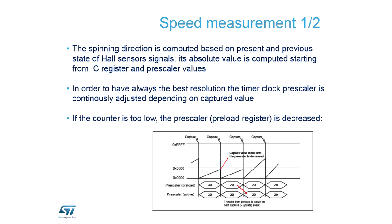We define a threshold and count between edge captures coming from the hall sensors combined through XOR to one event. These capture events reset the timer. In the interrupt service routine we decide: if the value is less than a threshold, precision is not good, so we change the prescaler to put faster impulses — the slope is faster. Using shadow registers, when we change the prescaler to 29 it takes effect in the next cycle, giving a better slope with improved precision.